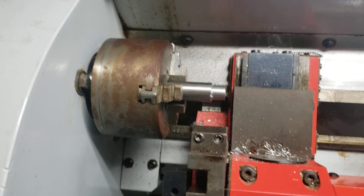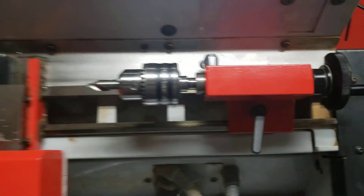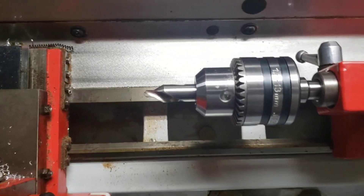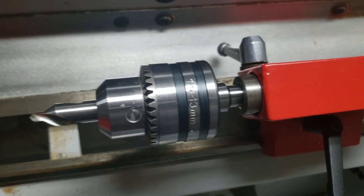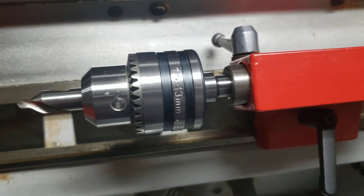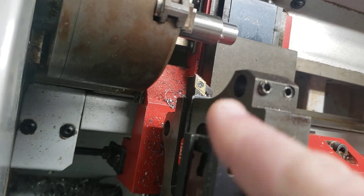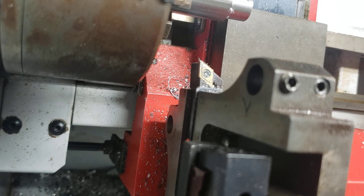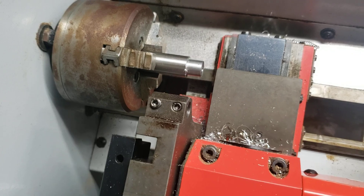Also, I got this, which looks like 20 pounds of potatoes in a five pound sack. I just did some testing with that, and the drill chuck seems to be okay. The tailstock's not the strongest thing in the world, but what I plan on doing is I need to make 10 millimeter sleeves for this hole here — 10 millimeter outside diameter with varying inside diameters for the different boring bars I'm going to be using.